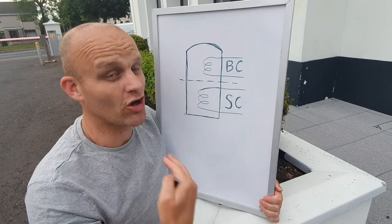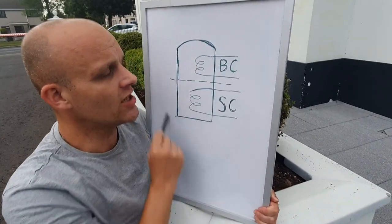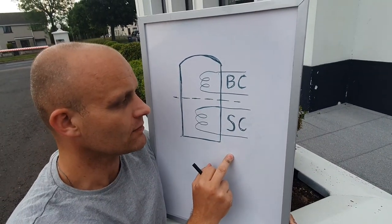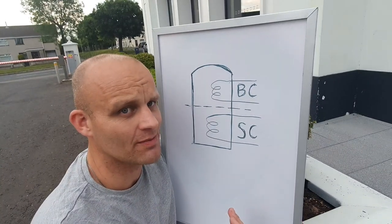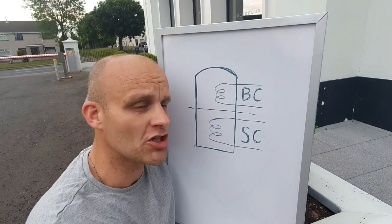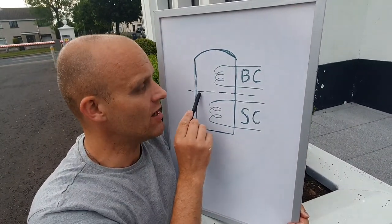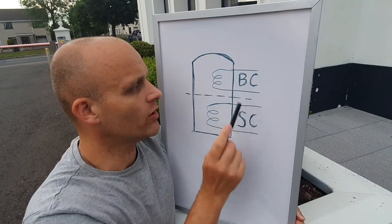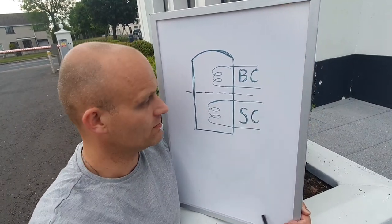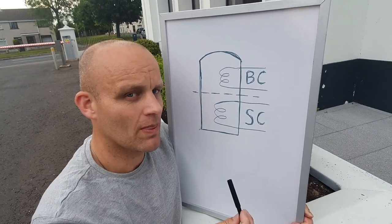When you're at the design stage, you've got to consider the cylinder. For solar thermal you need the correct cylinder - this one is especially for solar thermal. The solar coil goes at the bottom so you can make the most out of the free energy. The top half acts as a safety feature, absorbing all the excess heat - don't forget the panel can get to over 100 degrees. You want to design it leaving at least 20 to 30% expansion. The coil needs to be about 10% of the solar panel coil area as well.